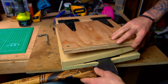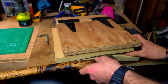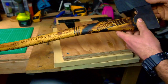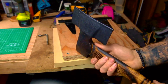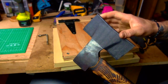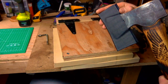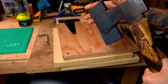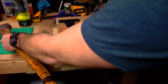As you can see here, I'm starting to open the press. Sometimes it sticks, so be careful — you don't want to rip it open and have foam get stuck to the kydex itself, because that becomes a pain. The form looks pretty good. There are a few lines on there from where the kydex was a little bit long on the grill portion of the oven, but I'm going to go ahead and start popping it off — it's got pretty solid form and good definition.